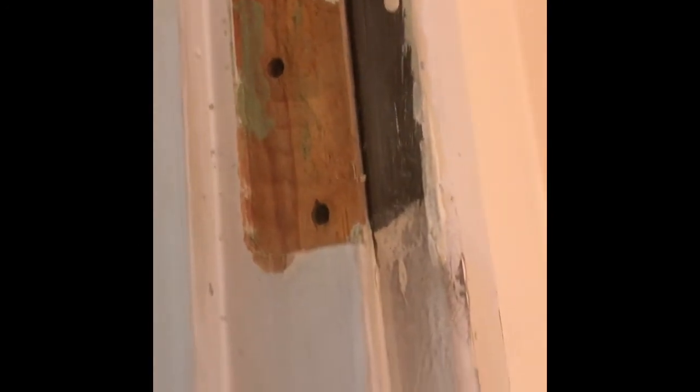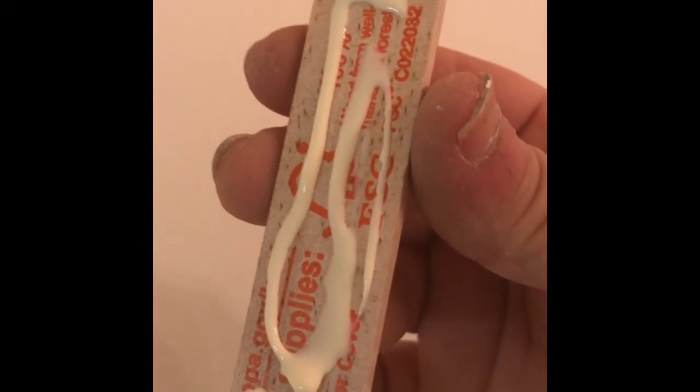We got it all cleaned up with the razor knife — just had to scrape a few nubbies off of there, no big deal. We put a little Titebond on the back of it and we put the piece inside. A little Titebond, slip it right in there, and wipe off the excess glue. Then take the pin nailer — headless pin nailer — and throw a couple pins in there, keeping it tight.